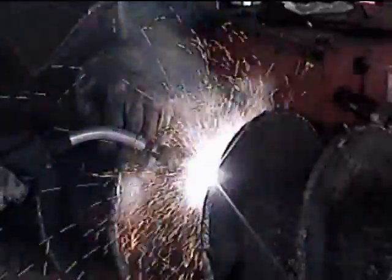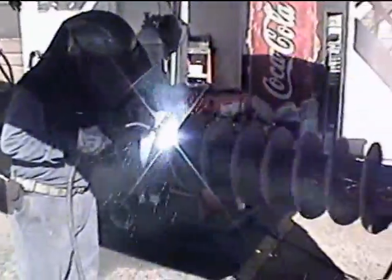To prolong the life, we're going to go in and hard-face them, which we've done in the past with some milder hard-facing wire. Now we're trying to use something a little better with the Vulcan. So right now we're putting on a first layer, then we'll come back and put the 260HF on right over top of all that. And then we should be pretty abrasion resistant.